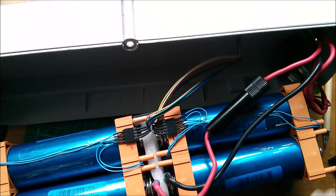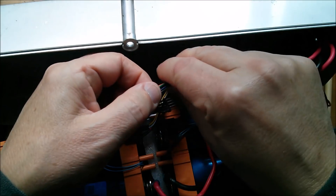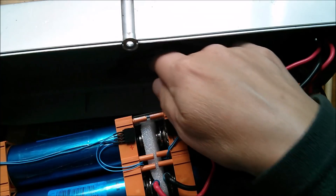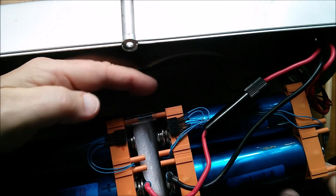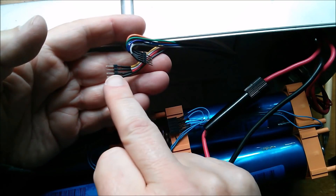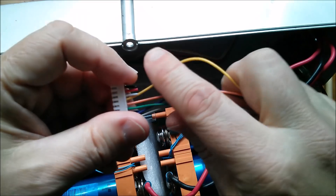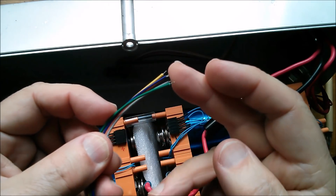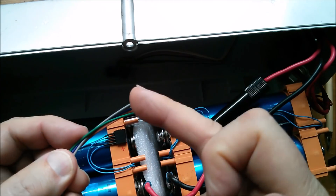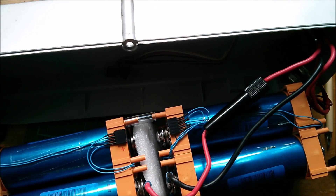The logic of this was to have two four-way connectors so that I can split these two packs. I've bought some more of these JST leads, but rather than use these connectors I might take it down to PCB-mounting JST sockets — four and five-way — and then have four and five-way plugs running into the connectors for the battery. But I don't need that for the moment. The best way to dismantle this is to split the two halves and get the positive and negative leads off.